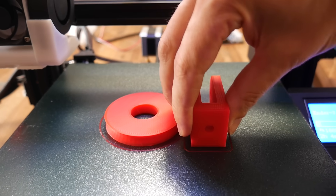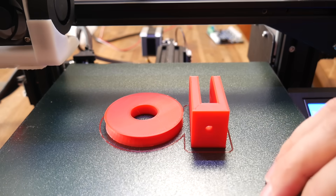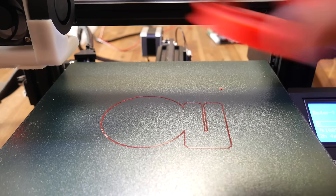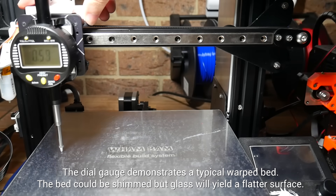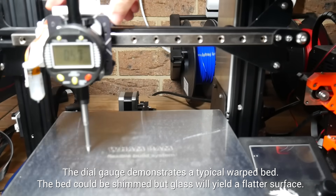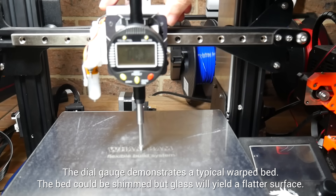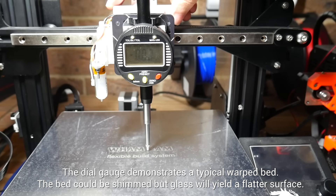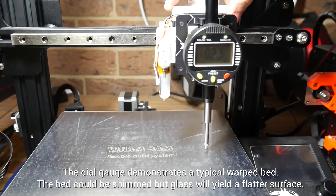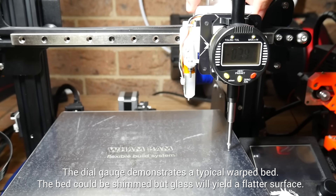This flexing can be quite subtle — a lot of the time you don't even need to completely remove the sheet; just a little flex from one corner will be enough to get the part loose. So how is this possibly a downside? If your bed is warped, the PEI sheet will conform to the shape of the bed and will still be warped. One advantage of glass beds is that they typically stay quite flat, even when sitting on top of a warped aluminium bed.